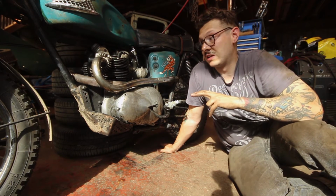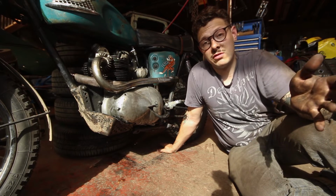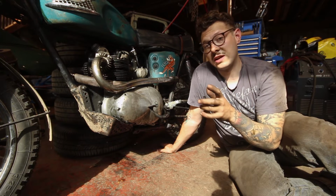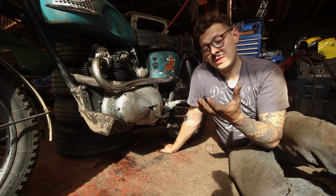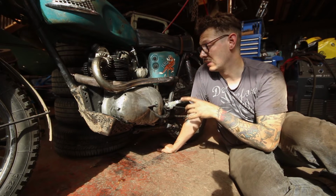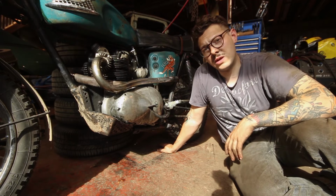So I'm really, really pleased that's worked, because quite often when you modify an exhaust, you put it on, you look somewhere and it's not quite right elsewhere, and you have to modify that bit as well. So that's really great. Something I did do in order to do that cut and shut was I actually used a hose clip to just shut that cut, and it worked a treat. So worth doing if you ever have to do anything like this. So the next thing I'm going to do is I'm going to secure all this lot in place, and I'm going to work out what I'm going to do with the back of the pipe.